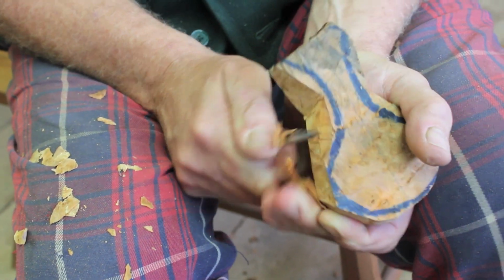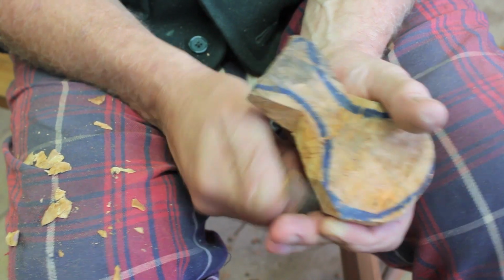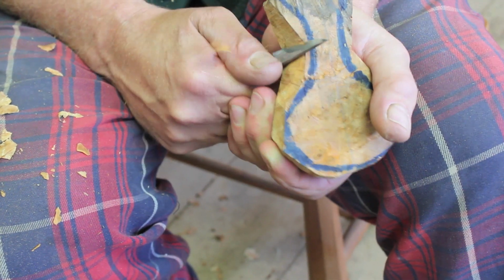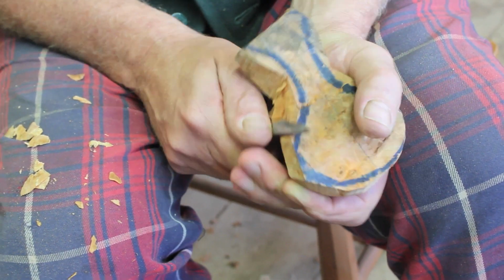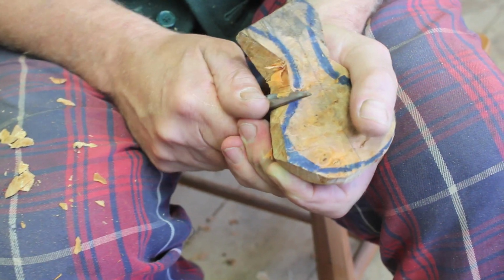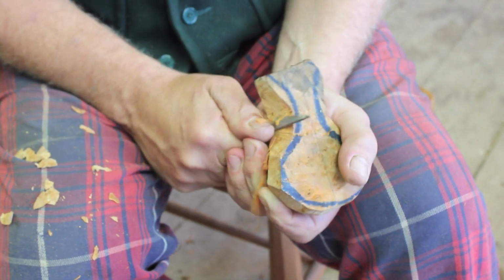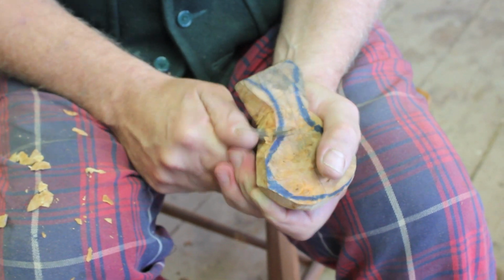So you're pushing your knuckles up, basically? Yeah, I'm using my left hand to push my knuckles, and actually I've got the knife blade held quite high up, so I'm not using the full length of the blade. That's often called the supported grip. People often think cutting towards you is dangerous, is a no-no, but actually if it's thought through, it can be just as safe.